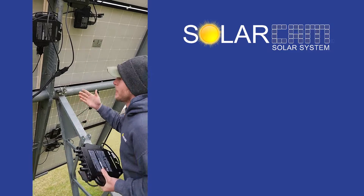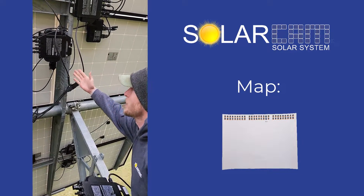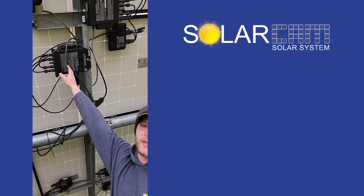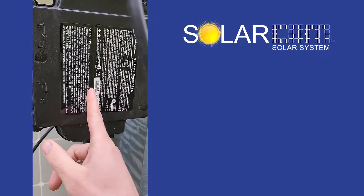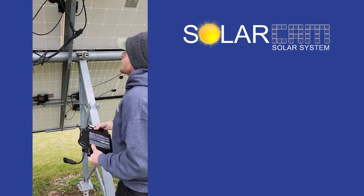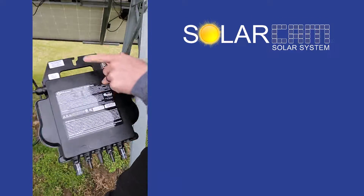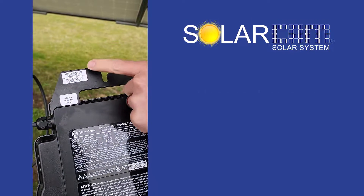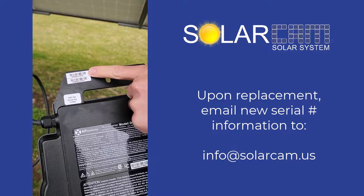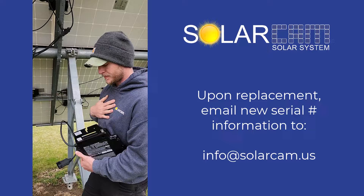The first thing you're going to notice on your map is the location of the bad inverter. Once you've found it — one of the ways you can find it is by the serial number up here at the top — I usually go off the last four digits, that's what I would notify you with. The first step would be taking the serial number off of the new inverter. There's a sticker here, as you can see, and you would inform me what this new serial number is so I can replace it with the old one on my computer system.